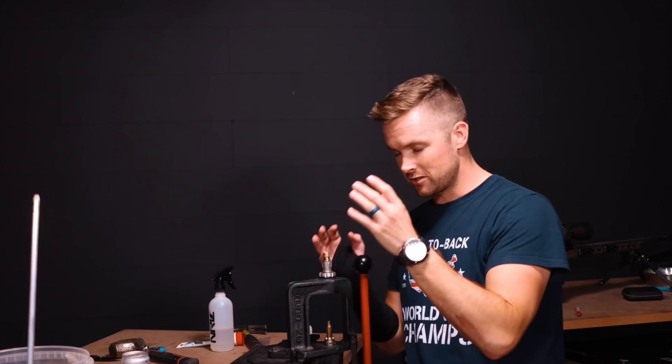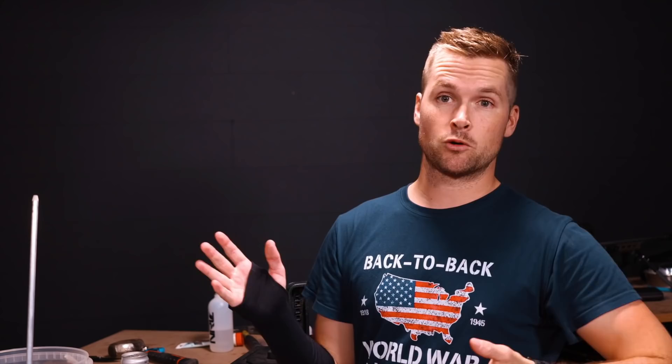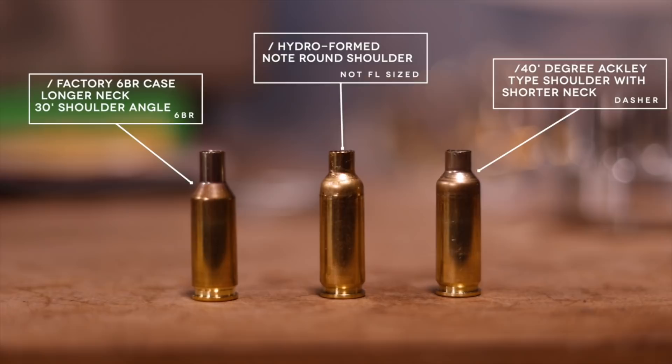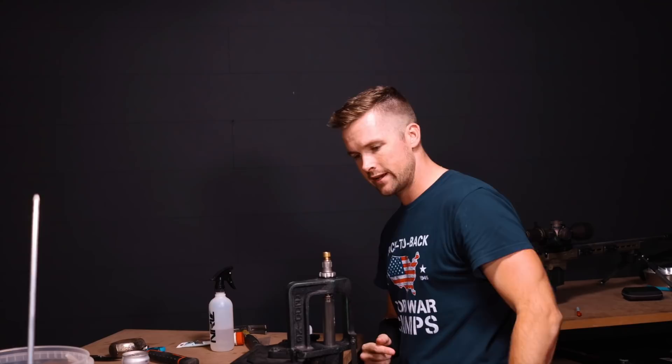I've set the initial ones up a little bit short, but going forward I've backed the die off a little bit. We'll run hydroformed brass through a full-sized die afterwards. I'm going to set the die a little bit taller so that when I full-size it down, I get rid of that roundness. There's a little overflow hole at the top of the locking ring — if you put too much water in, it'll come out the side when you insert the plunger. It's so weird working with water and reloading — it just doesn't make sense almost.